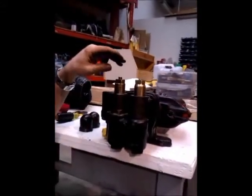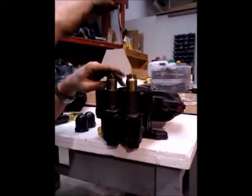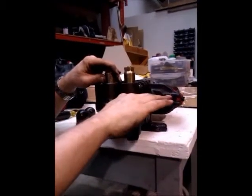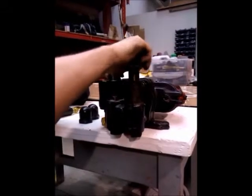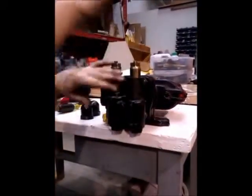Cap nuts go back on, you run it back up again. Now it's pretty close to 70, which is where we want it. So it cuts out. Now we'll drop the pressure back down to see where it's going to cut in. We raised it a little bit last time, so now it's maybe around 45 pounds. We want it up around 55. You don't want to get them too close together, because it'll cut in and cut out and you'll get arcing — really severe arcing.